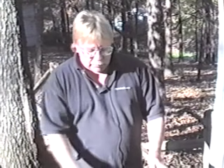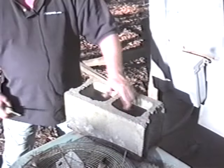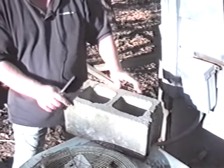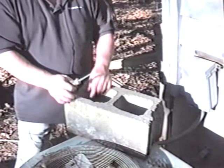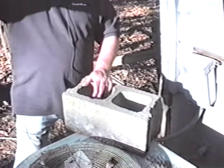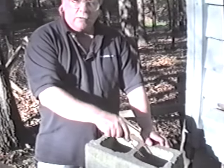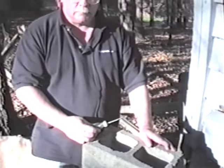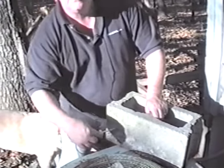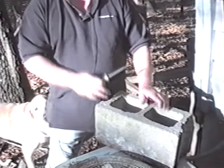On the inside of your foundation, it's made of concrete blocks such as this. One side of these are actually covered, and they would be like this, flat, whereas the other kind have these holes coming up in them. That's where your termites are going to come up and get into your wood. So this is just a visual look of what you can't see that we were showing you on top of this cap, that was in the garage. It's these holes that the termites will come up in. And this is why they drill the holes that would go inside these to treat with chemicals. It makes these cavities of holes in there. It puts the chemicals in there that kills the termites as they come up.